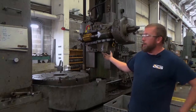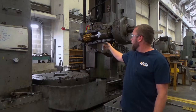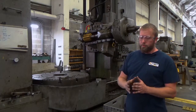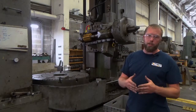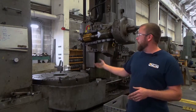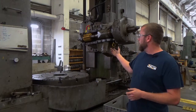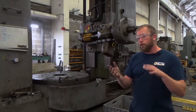Your gear geometry is set on the hob you use. The carbide tool in the head is a gear hob, and they're set based upon pitch, which is the amount of spacing of the teeth. Then you have your angle — your pressure angle. So if you have a known pitch and pressure angle on a gear, you use the hob accordingly, and the head itself rotates on an angle to set your helix angle of your gear.